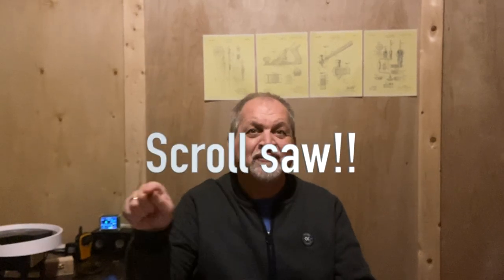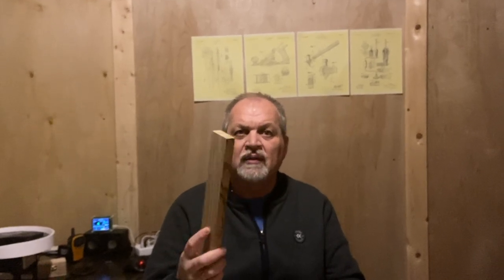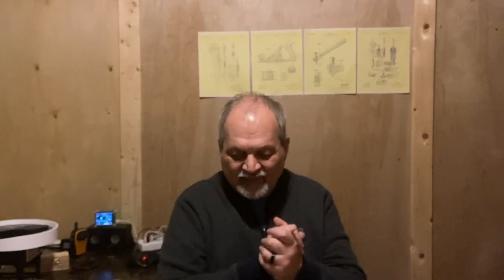A lot of times, furniture maker shops use bandsaws versus table saws for that reason — a bandsaw wastes much less wood. There are saws better fitted to waste less wood, and using a hand saw like our Japanese saw will waste very little material. But as a beginner, you're going to waste a lot of material anyway. When we started, we were horrible — we wasted wood, did things wrong, measured wrong. It's all part of the learning curve.